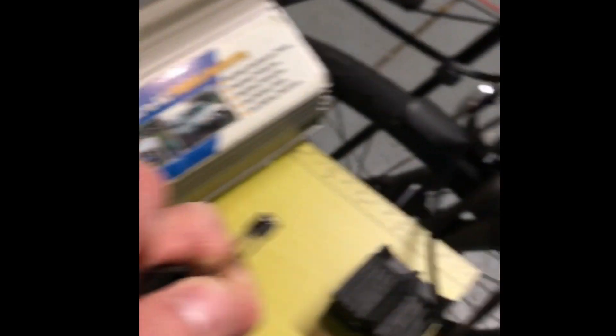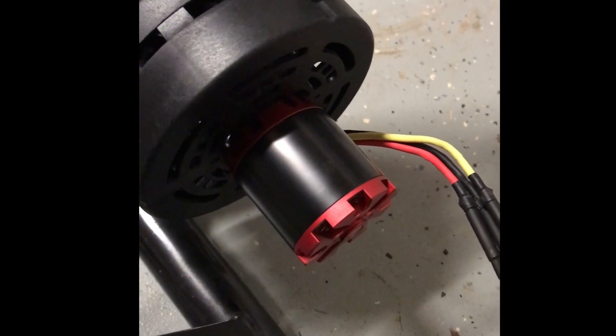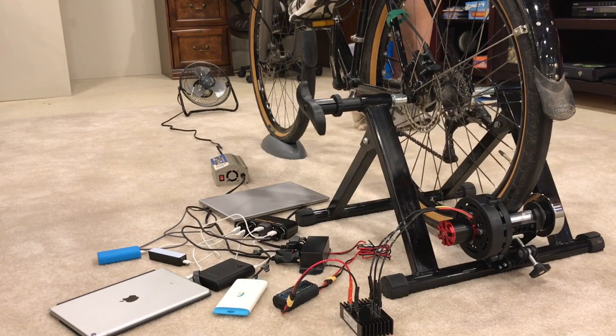So let's take a look at the setup. I've got the 320 KV RC motor hooked to the bike trainer — we could have gone with a 350 or 400 KV motor, but this one works really well for what I'm trying to accomplish. You can see where I taped the wire to the frame with hook-and-pile tape connectors, coming right up into the box where I have the bridge rectifier, a meter, and a couple of sockets. I like this setup a lot. If you like what I'm doing, click the links below for the Amazon products I used to build this. Thanks for watching and please subscribe.